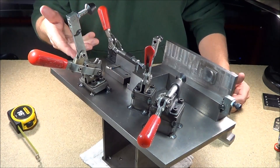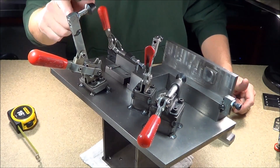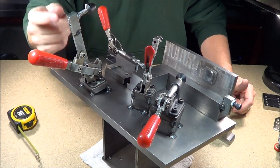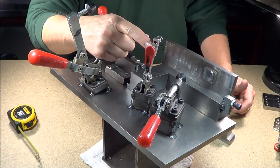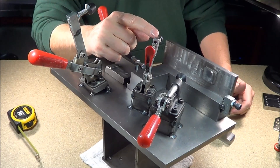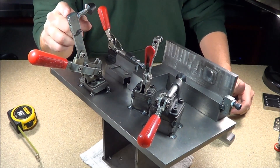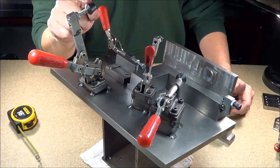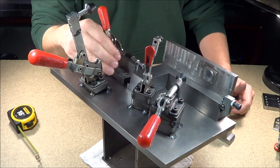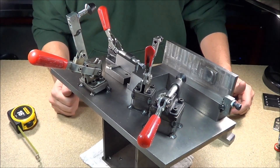It's very repeatable. You can put your parts in here, but you have to keep it clean. This is how we use our actual external threaded bolt retainers — like you see one here on the 215 series horizontal clamp. You see a steel tip on the bottom because it gets pretty close to a weld where it's pretty hot. On this one you see a rubber on the end because it's a little flexible and has to go around, and it's a little farther away from the actual weld itself.